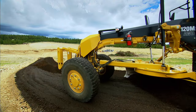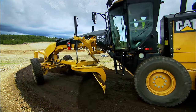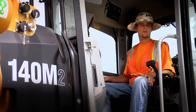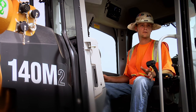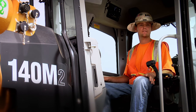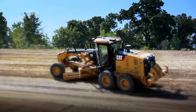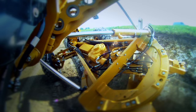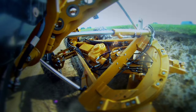We're doing a lot of airport aprons, finishing infields so they can pave them for dust control. I'll be running chasing scrapers, doing haul roads, wiping stuff down, roughing stuff in. Then later I'll be finishing subgrade for the road and after that I'll be finishing the AB. For added versatility, all wheel drive machines give you additional traction to work on slopes and in soft underfoot conditions. And a movable link bar allows you to grade on extreme slopes more easily and safely.